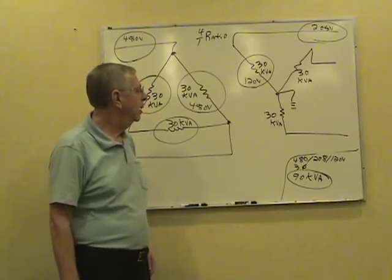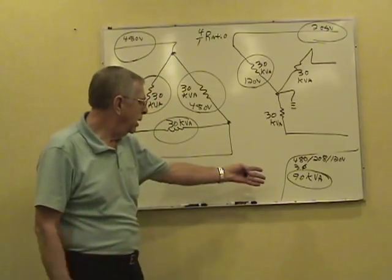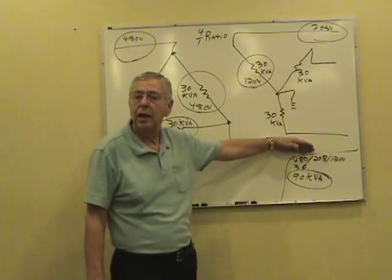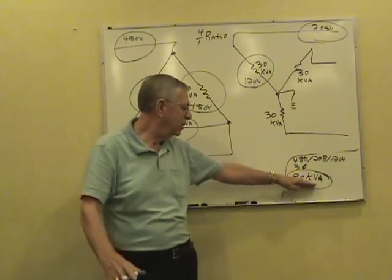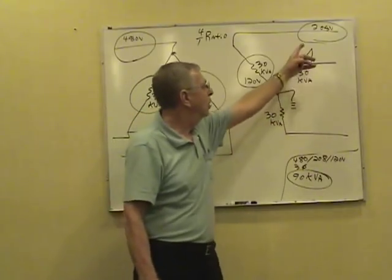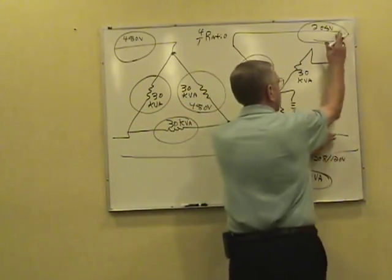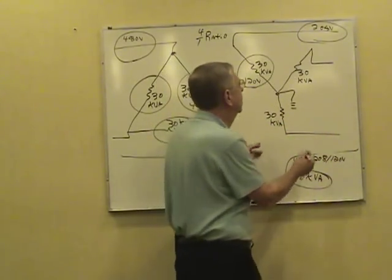Okay. Maybe they ask us, on a 90 kVA 480-208-120 three-phase delta-Y, fully loaded, maxed out, using all 90,000 watts, what's the line current in the secondary? Now that's a three-phase question. A three-phase load is connected out here, and we're using all 90,000 watts.